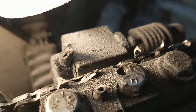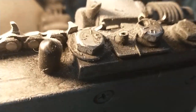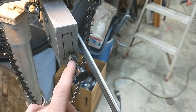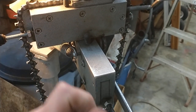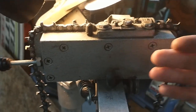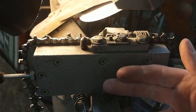There's the catch - you see it catches the chain there. These are all stops; you can set the stops up and just grind a chain. That handle moves this, pulls the chain into the wheel.